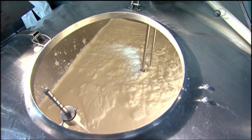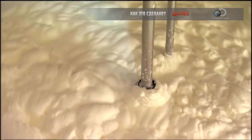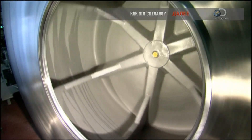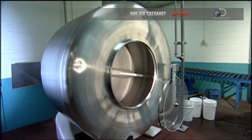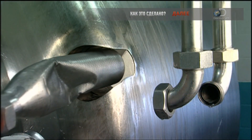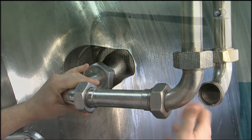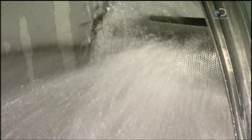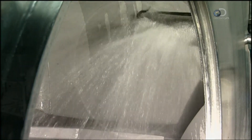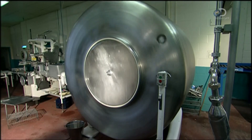Back to the buttermaking. The buttercream is put into a bulk tank where mixers stir it to maintain consistency. After pasteurising and then ageing the buttercream for 24 hours, workers prepare to transfer it to another machine called the churner. First, the inside is filled with water mixed with iodine, which removes any germs left behind by the previous batch. The churner is spun for about 5 minutes before being rinsed out.